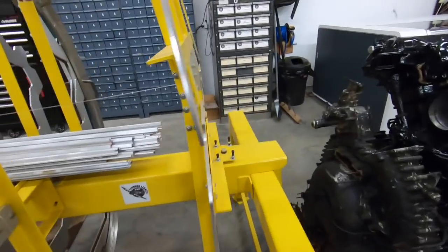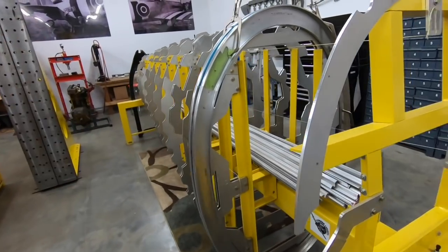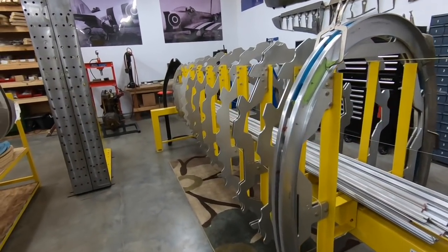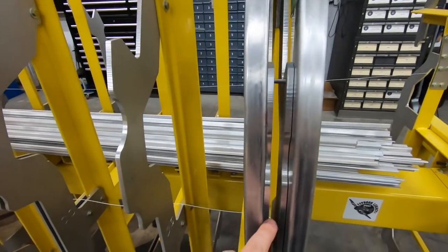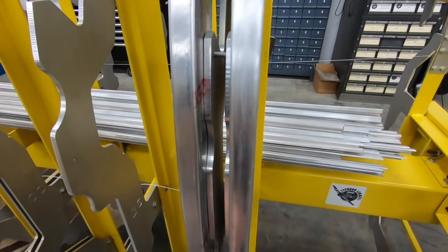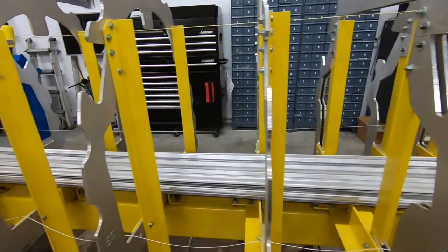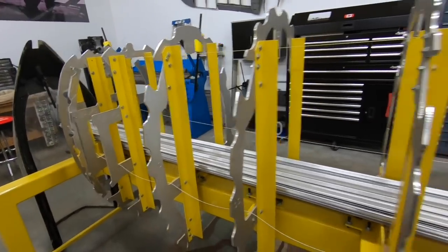So beyond that, every frame, as you look down the fuselage here, these are all station plates. There's only a couple actual Typhoon frames in place right now, but these quarter inch 6061 T6 aluminum station plates were routed out, and they hold the positions of each of these frames, some more complex than others. You can see frame A is a double frame, so there's two plates. They don't have them in here right now, but there's spacers that go in between to make sure these are held to the factory dimension apart from each other, and these all hold the frame segments in the correct location for drilling and assembly as we're building the monocoque.